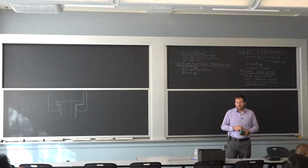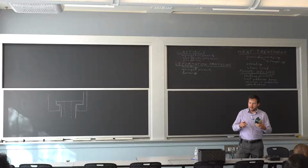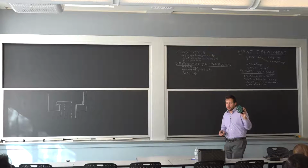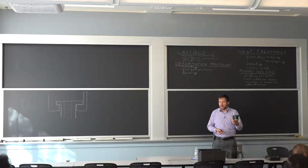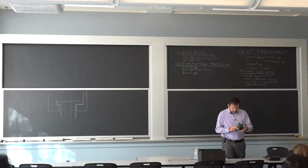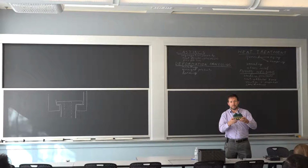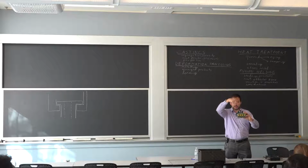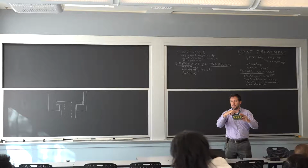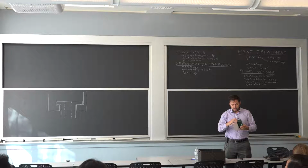People learn different ways, I'm sure, engineers included, but getting a product, getting pieces, or getting a prototype really makes you think. We could go all day long going over what injection molding is, but when you look at just this piece of equipment that they sell for $30, it has a lot of process engineering in it. If you remember the video I showed about die casting, they had inserts coming in two different ways. So this part was built that way. You had the mold, but you also had pins coming in to make the holes in the connection. So this was built as a single piece by injection molding, all the way to the black here.